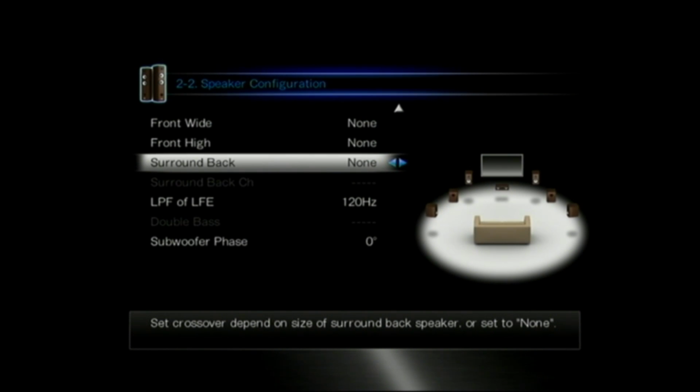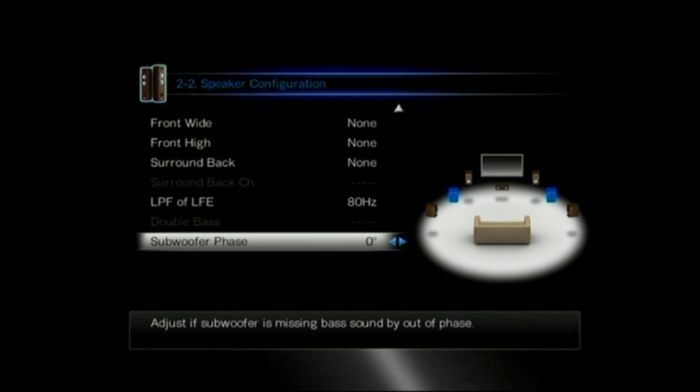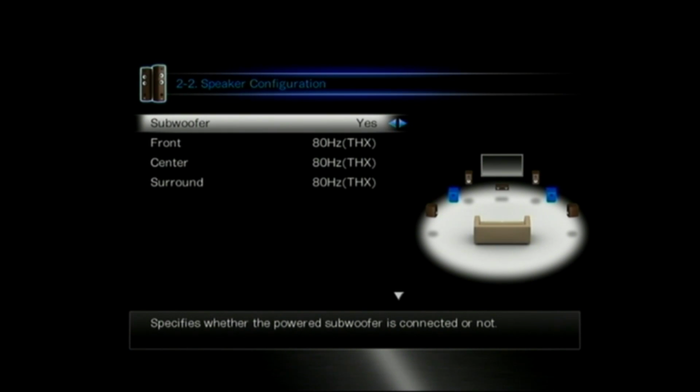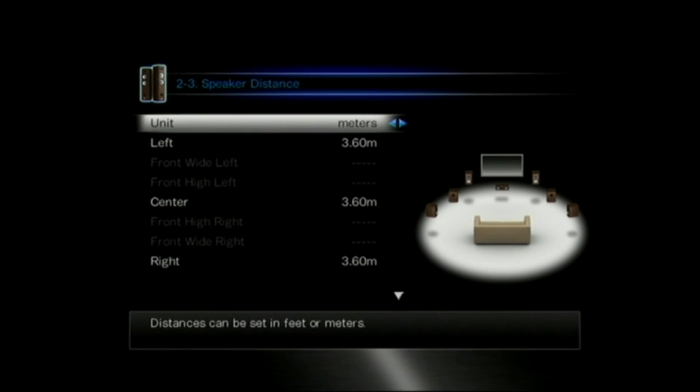Just mentioned a little bit before about biamping. We would actually recommend that you biamp if your speakers are capable of doing it, because you're going to get a much better sound quality, especially for stereo, if you were to use additional amplifiers. But obviously you don't get the additional 7.1, which is really useful obviously on Blu-ray and then for things like games as well.